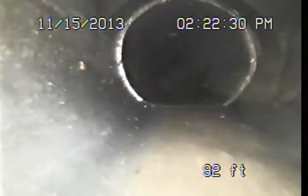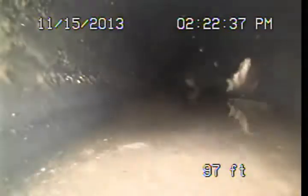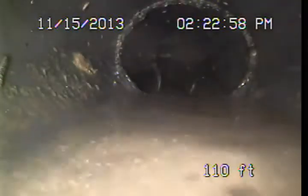The potential concern for this line is that debris can build up and cause blockages — so this is just not the proper application for this situation. What would really be needed in this case is a sewage ejection system. That would be the proper application for this type of structure given the elevations we're seeing. I don't see any way further out into the line where you could run it further to get the proper fall — the elevation changes just aren't going to be enough. There's a much increased potential for debris build up to cause blockages.